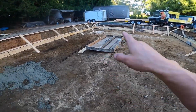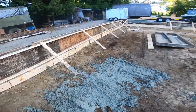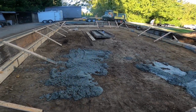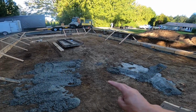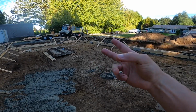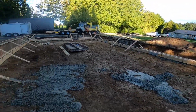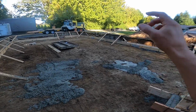A shame that I turned the camera away in the last moments there in the heat of the battle. But yeah, the most critical thing when that sponge gets within a couple hoses of the end, things start happening at a very rapid pace. So you got to be on it, and you got to be on the radio. Only 2 guys on radios. We've had jobs before where we've had 3 radios and one guy talks over the other guy and the signal to dump the air is not conveyed and bad things happen. So only 2 radios going, and just be on top of it.